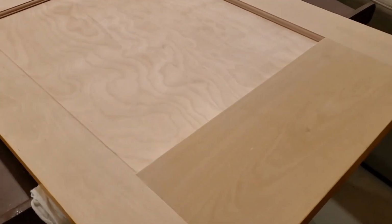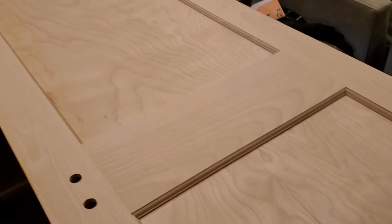So birch is an interesting wood. You'll see as we put the shellac on that there's the grain, but then there's also this tiger striping that goes crossways to the grain, which creates a kind of holographic effect. You can see a little bit of that tiger striping there on the top, but that'll pop out once we start putting the shellac on.